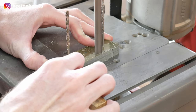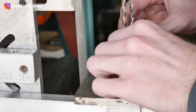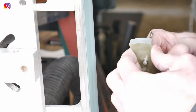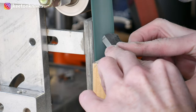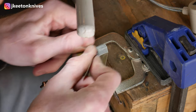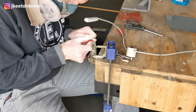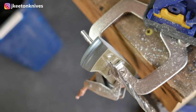We're going to start off by rough profiling these handle scales on the bandsaw, then move over to the belt sander to get them profiled out. Where you really want to focus is on the front of the scales — we're not going to be able to come back and mess with the front after we glue the handles onto the knife. I leave a little overhang after glue-up. Then we chamfer the front of the handle scales with a 45-degree wood block. After rough chamfering, I head over to hand sanding and get it clamped up — hand sanding the front of these scales to around 1000 grit, starting with 320, moving to 600, and then finally to 1000 grit. This G10 polishes up really nice with 1000 grit.